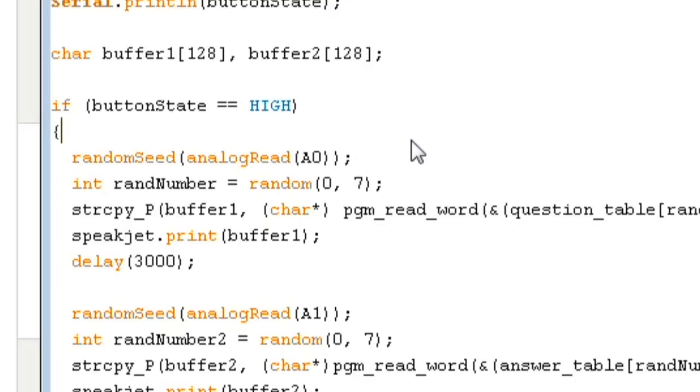to read. The reason we do that is because those strings take up a lot of memory, and if you were to initialize them into the fairly limited system memory that the Arduino has on boot, you would very quickly find yourself overwriting the entire system memory that's available, and that would cause your program to do all kinds of weird, flaky things that would be really hard for you to ultimately debug.